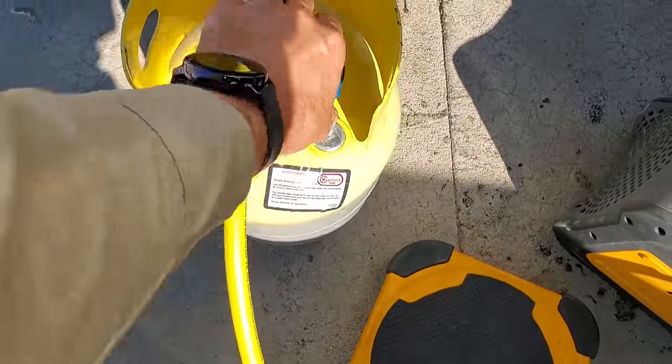All right, it was done taking it on the high side. It took about 4 pounds. What I went ahead and did was pull off the port, put it onto the low side, and turn the system off. The way that I turned it off was by putting it into unit test mode, and then I'll actually turn it on, and we're going to finish charging through the low side once it starts up.